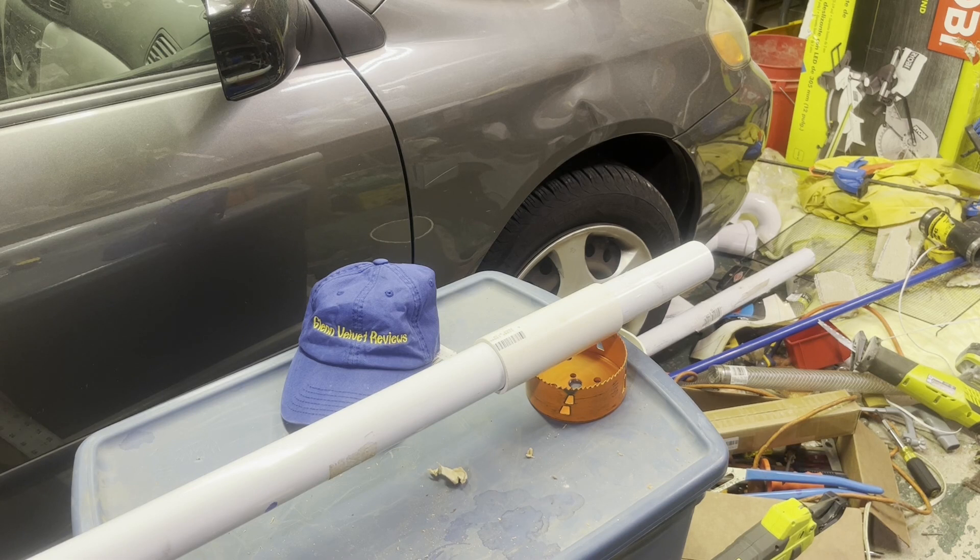Central vacuum piping is like Schedule 20 — it's very thin-walled compared to Schedule 40 or Schedule 80. Schedule 40 is just a lot easier to cut with this kind of machine. This machine does not work well on anything less than Schedule 40 because it just squeezes and deforms it. Maybe it would work with a brand new blade, but it wasn't working for me.